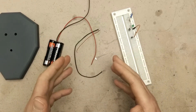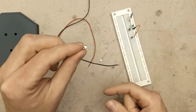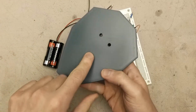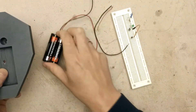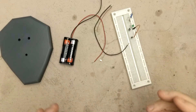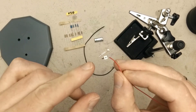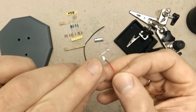So now it's just a matter of assembling everything together. I will start by soldering all the LEDs to the resistors, add some cables, wire it through this hole, then wire the phototransistor through this hole and connect everything to the battery pack — and then hopefully everything will work. A small change of plans: I will not use the small SMD resistors. Instead I will use the bigger ones, because it's really hard to properly solder wire to those little pads.